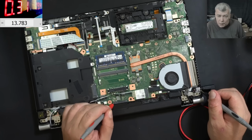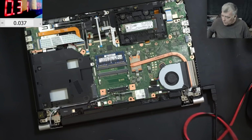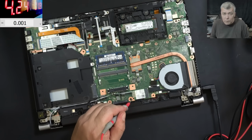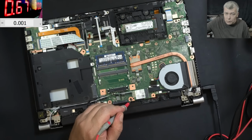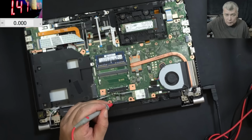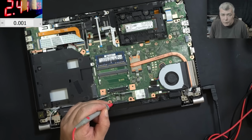We have a fuse here with the battery. So the voltage is low. Okay, that's fine. Let's see what current do we have. 4 amps, lol, too much. Okay, coming with current onto the battery and it's charging with 2 amps. Yeah, the battery is fine. Check that. The voltage goes up to 15.6.